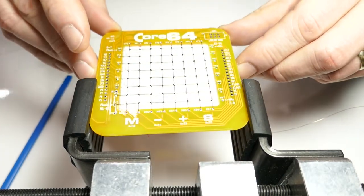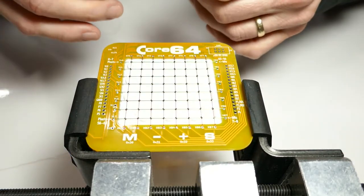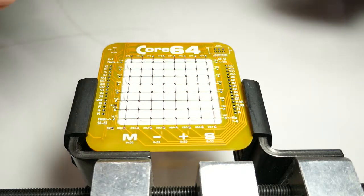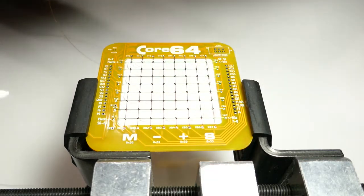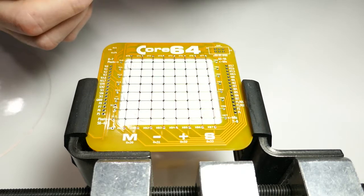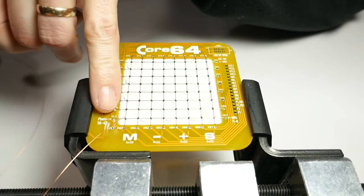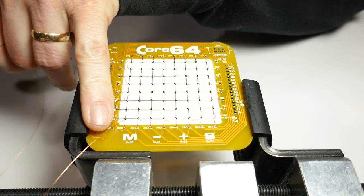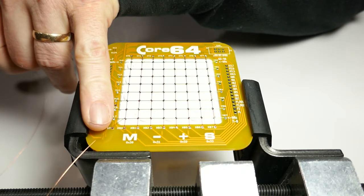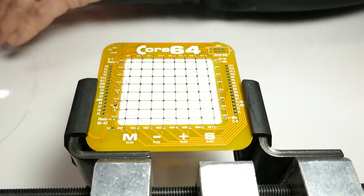So to start with, of course you've taken care of your sense wire and straightened it out more or less. Doesn't need to be perfectly straight, but most importantly free of any kinks or nicks or any sticky spots. And then you start position, this is labeled position 1 here on the weaving fixture. I'm just going to go right through the top of this core, top of the cross wires I mean.